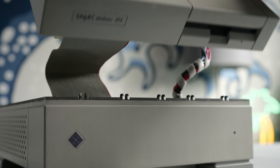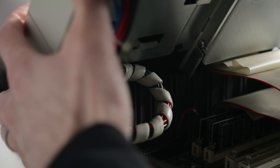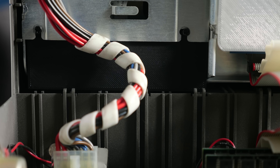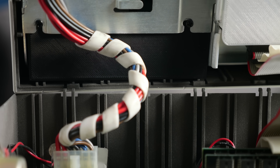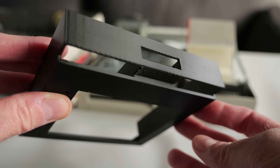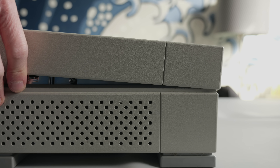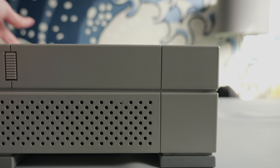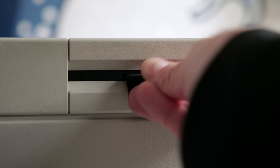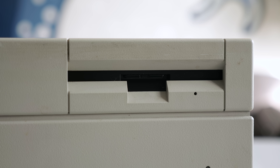I found a problem when I went to close the system up—the lid wouldn't hook into the tabs at the front. It looks like I forgot to take this into account when I designed the floppy drive bracket, so I whipped up a new revision. This one has a notch in it to keep that whole area clear, and after swapping it into the drive bay, the case closes up just fine. You can hardly tell it's an SD card reader now. Of course, there's a link in the description for this too.